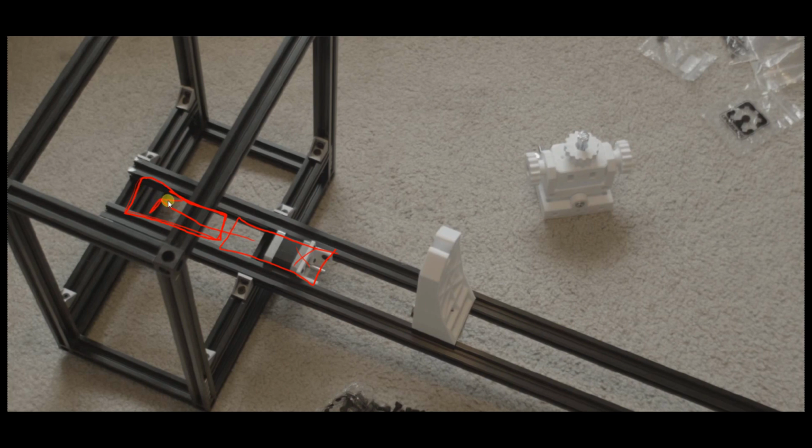So what you're going to do is put the gantry plate down here. Make sure you've got a little slop or play. Go ahead and clamp these brackets as well now, these guys here. After you're done with that, take a ruler or whatever you can use to measure accurately, and measure between the side here and the inside of the frame. Make sure this other part on the other side, from here to here, is identical to this distance, whatever it happens to be that you choose.